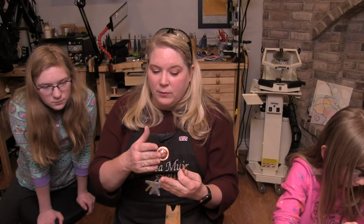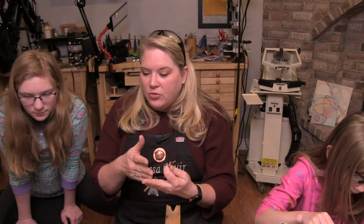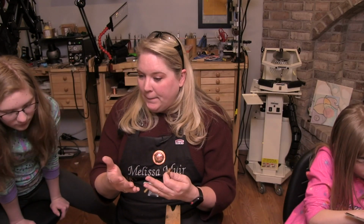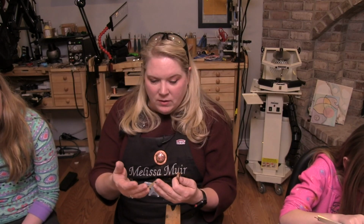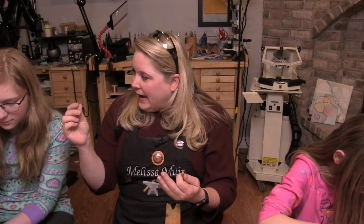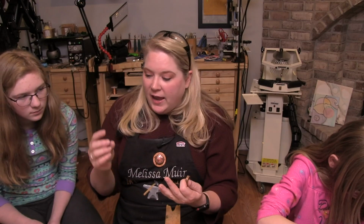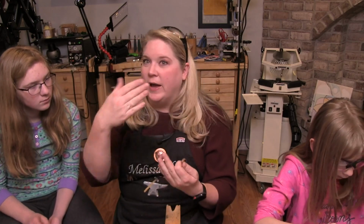But what I want to do is I would go from the 600 grit, I would do a Tripoli. Now a Tripoli or Red Rouge, those are compounds that still have a little bit of abrasive to them, okay? Not the Red Rouge, because I think that's a finishing one. But anyway, your Tripoli. Now, your Red Rouge is one that you end with because that's the polish, because it's a really fine, smooth one. So you would go from Tripoli to Red Rouge. Okay, but there's several that have a little bit of a grittiness to them, but it's so much finer than what you would have with your sandpaper or your files. So you would do it after those.